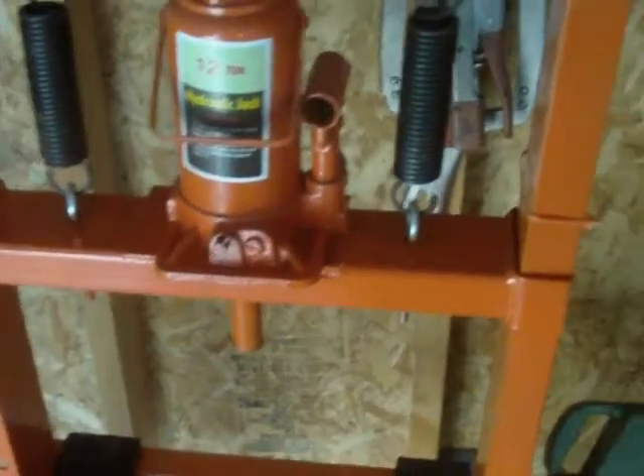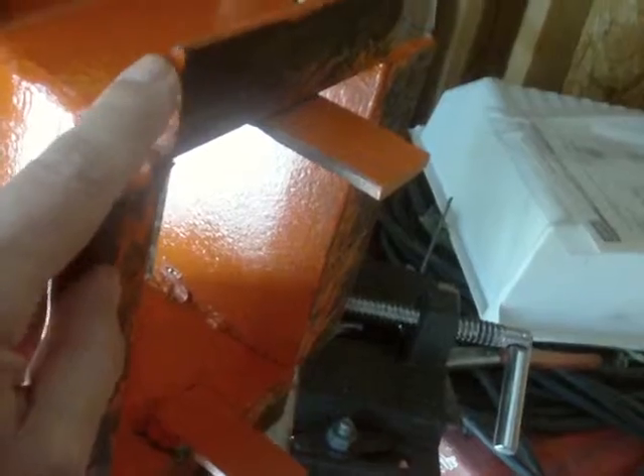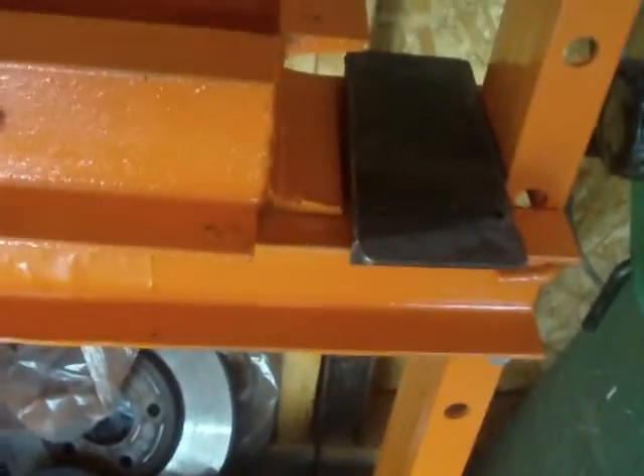To help combat that, rather than staying frustrated that my press was a little bit small and delicate so to speak, I built an adapter. You can see I've made it out of four-inch channel iron, and this four-inch is a lot thicker and a little bit wider, so it won't bend as easy. I put these arms down here so that when it slides in, they fit between the sides of the press, and that way when you raise or lower the bed this piece isn't going to be sliding around and falling off and hitting you on the feet. It just sits on top like that, and I've allowed it to have some movement so you can always line your pieces up.